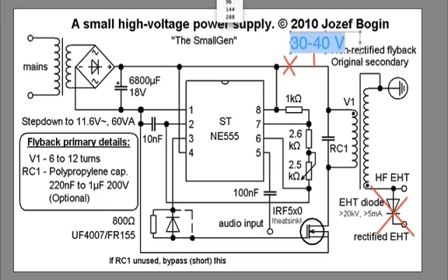12 volts at the primary coil will result in some measly sparks — satisfying but not very big. Running 30 to 40 volts will work, though the MOSFET gets quite hot at those levels. 20 volts is more than enough to run it for a sustained period and it'll sound pretty good. That's probably the major modification to the whole design. Both power supply negatives should be connected together for a common ground.